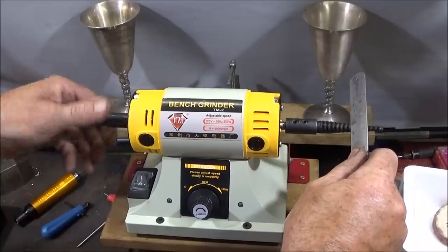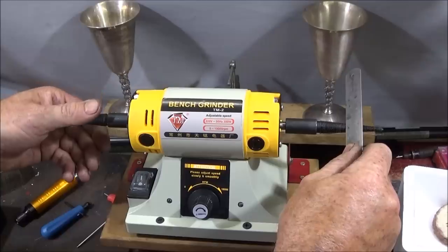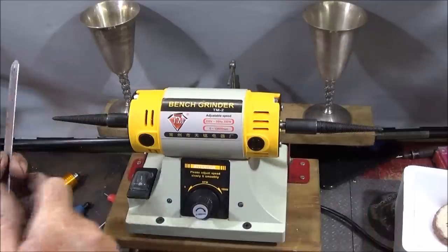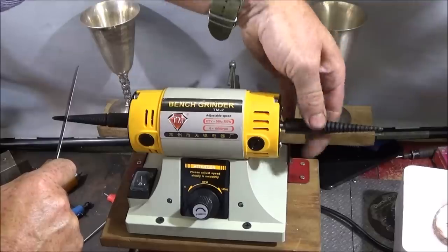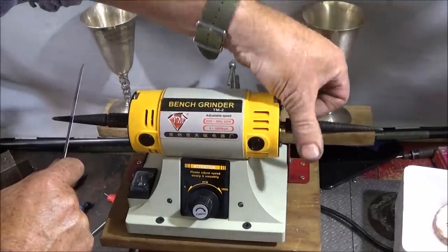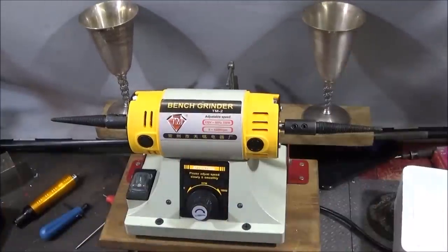If the ruler is carried up the actual mandrel like it is there and screwing towards the buffing machine, then it's correct. And obviously do the same this side. Remember to go forward on the spindle, and that one's screwing up the thread as well. And that's most important, all the wheels won't stay on in use.